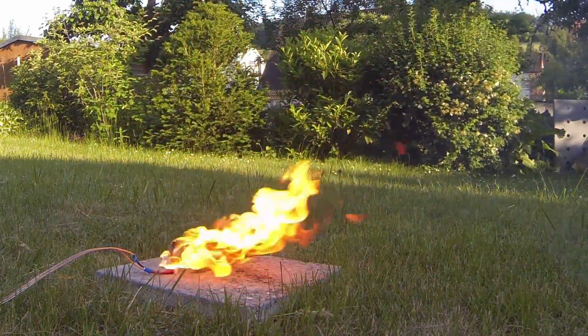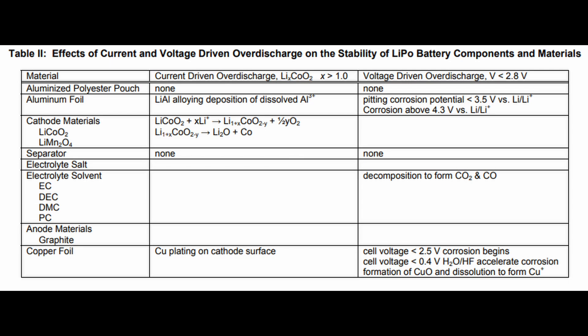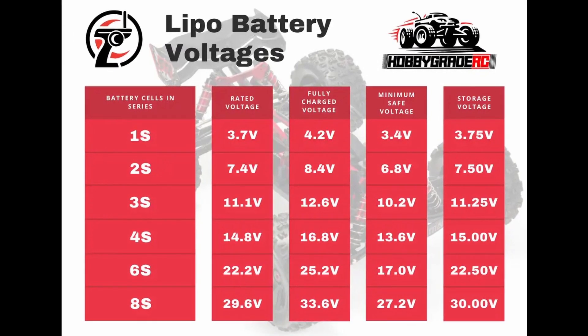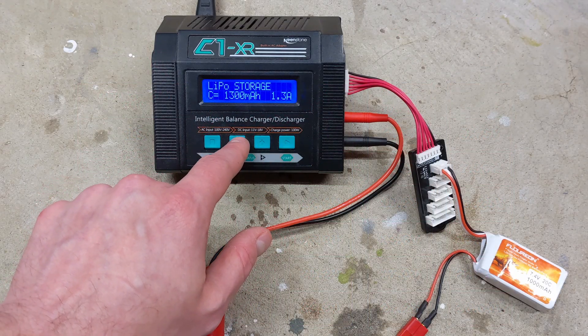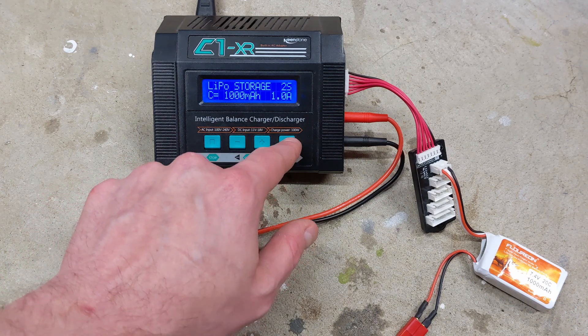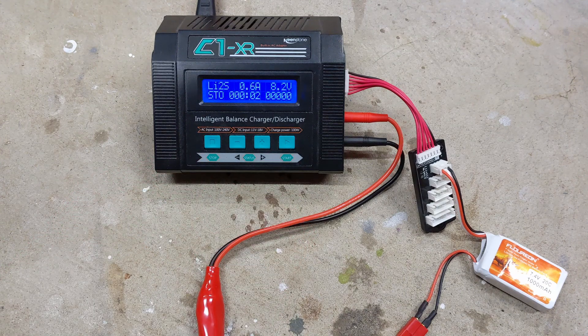At the other extreme, a LiPo that drops below three volts per cell will also start to develop permanently higher internal resistance, and this can render it unsafe to charge again. So rather than full or empty, a LiPo should be stored at the storage voltage — just above its nominal voltage. On the smart charger, if we change the setting to storage and run it again, it will either charge or discharge the battery until it reaches the correct voltage for long-term storage. As a general practice, we recommend charging batteries the night before a game and then running the storage function as soon as you get home — this will maximize the lifespan of the battery.